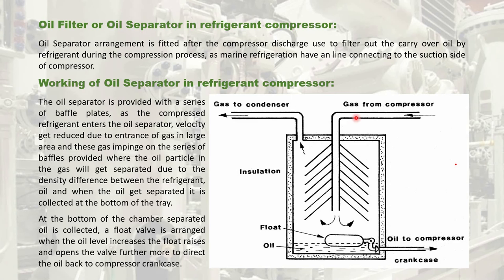If the oil filtering equipment is malfunctioning, there will be problems with the compressor's moving parts due to high heat generated, causing the compressor to malfunction. For the system, this oil travels with the high pressure refrigerant to the condenser and the rest of the system, causing damage leading to a decrease in evaporator capacity or an increase in compressor load. Now let us look into the compressor unloading mechanism or capacity controller valve.